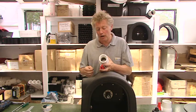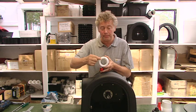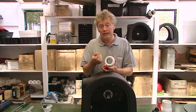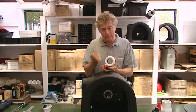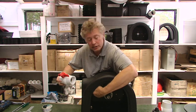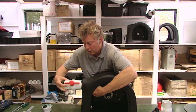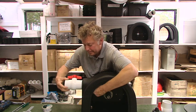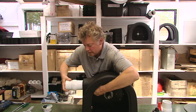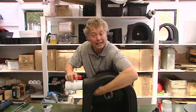Pick up the valve and note that one end has the word 'jet' on it — that side obviously screws on to the jet assembly. The other end of the valve will be threaded for the thread that you specify when you order the turbine, either BSP or NPT. So we'll take that jet end again and, holding on to the jet holder from the inside, having lubricated it, it should turn fairly easily until it tightens up. We always tighten them with the valve handle to the top.